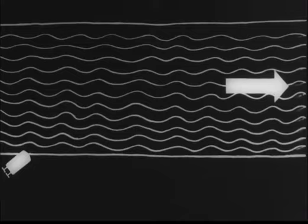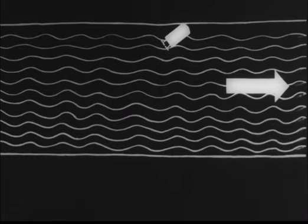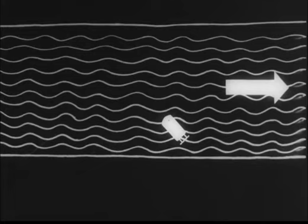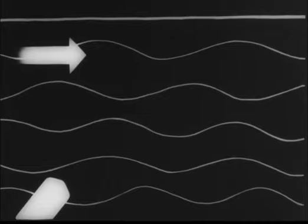Crossing a river with the DD is a ticklish procedure. It's usual to cross at an angle with the current if it's fast, or possibly against the current if it's slow. In either case, the difficulty occurs on landing at the far bank. It must be remembered that the tracks are in motion at the same time as the propellers.